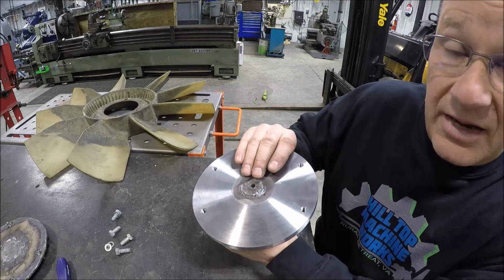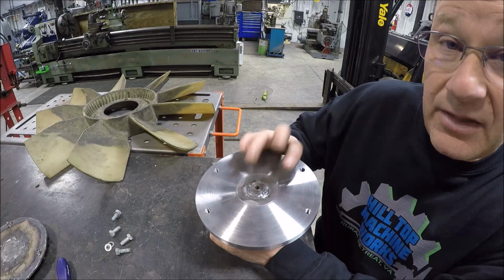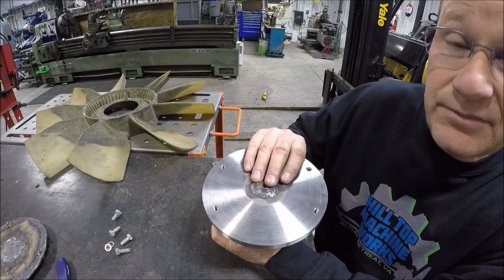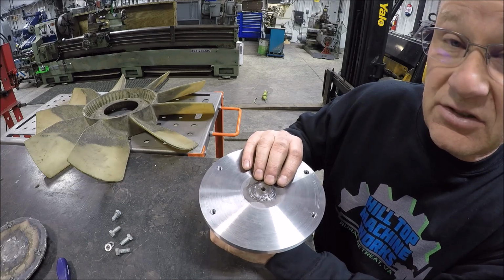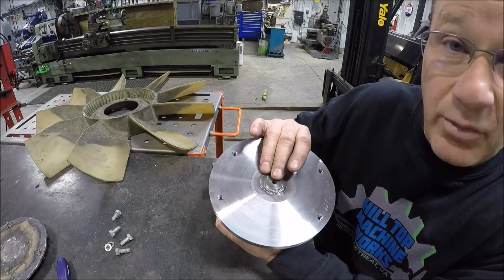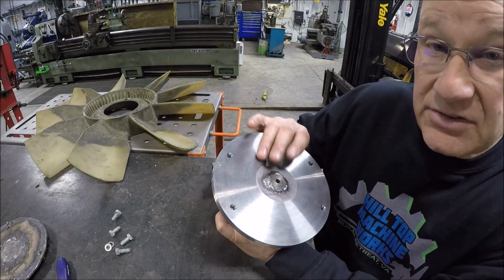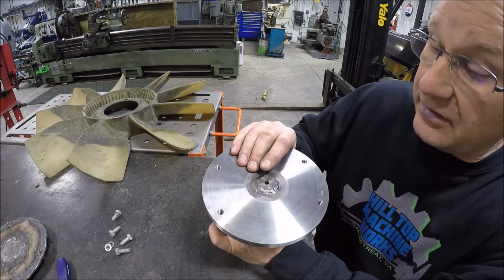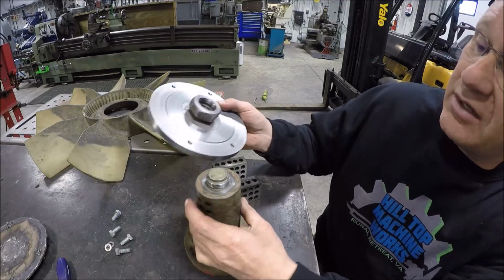Basically 1.5 thou in the radius, so the hole was 3 thou large. I had the boring bar choked up as much as I could choke it up. I was using the largest size possible, but it's still a small boring bar because we had a small bore anyways. So I don't know, may delve into that cross slide, see if there's any issues in there. I haven't since I got the thing, so don't know. But anyways, all in all, I think it came out pretty good.